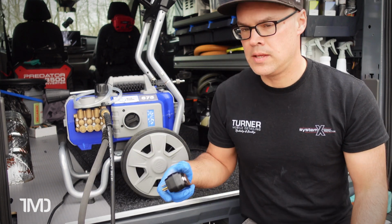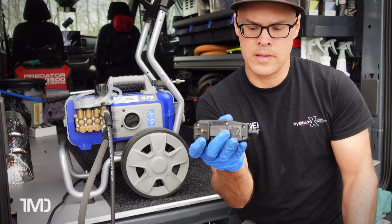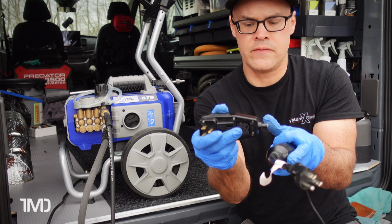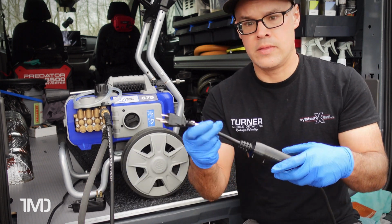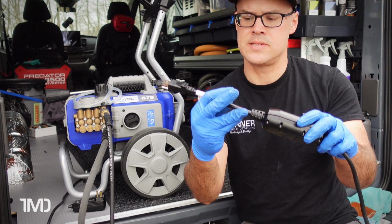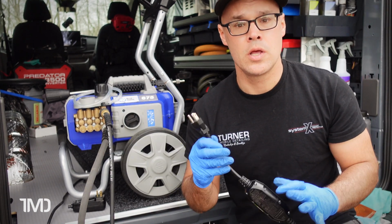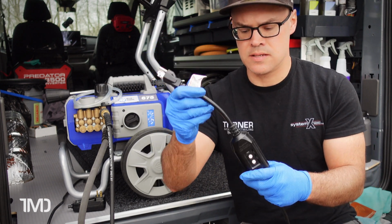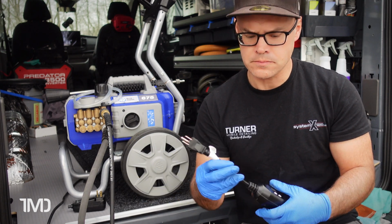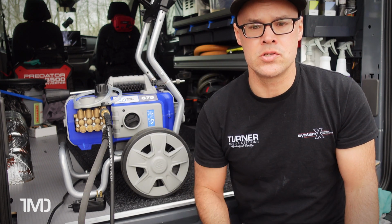And it's very hard sometimes to fit them in there. You have to finagle them in there or bend the cord at a really acute angle to get it to fit in order to plug into it. But with this, obviously you're not going to have that problem because this is about 6-8 inches back from your plug. You just plug this right into the outlet. No muss, no fuss, no problems. So again, it's a very easy fix. If you have that problem with the electrical in your unit, it's not turning over, no power, it's probably a GFCI. I recommend an item like this. And again, I'll leave a link in the description below.